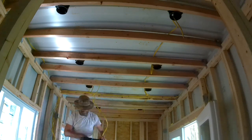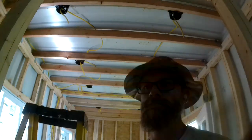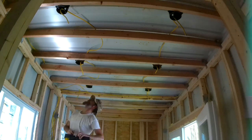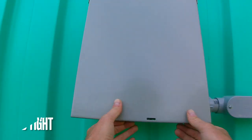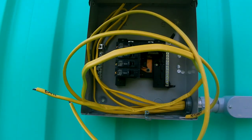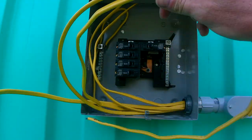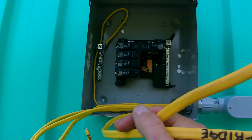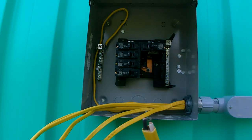These lights are gonna be on the three-way switch — this is bedroom, living room, and kitchen. I initially thought about putting all of them on separate switches, but I just put it all on one switch. And then this is what you end up with when you run all of that wire — you run it all into the box, and they're all labeled so you know what each one is. Again, like the fridge, that has to be on its own line, its own home run.